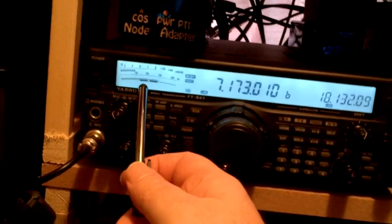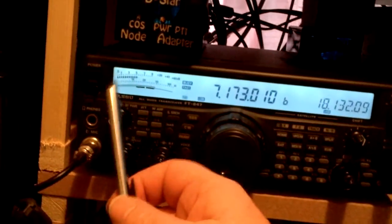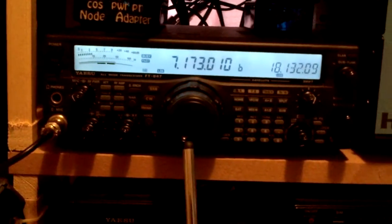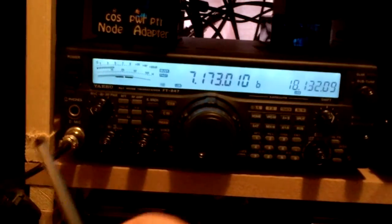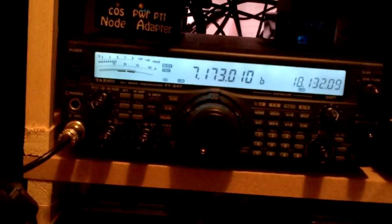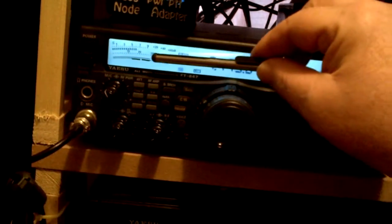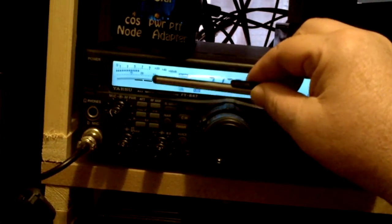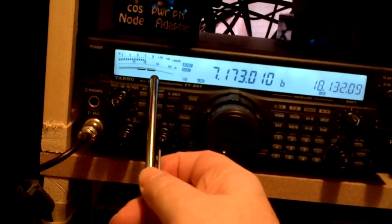Even on SSB — let's say for that part — on SSB when I key my mic up and don't put any audio through, it'll probably still be on 20. When I'm talking with my processor on, using a standard mic with processor on, then when I talk, make sure as you can see from there it doesn't go above 50. It's just below 50 — there's your line just there, that's not the bottom line, the next one up.